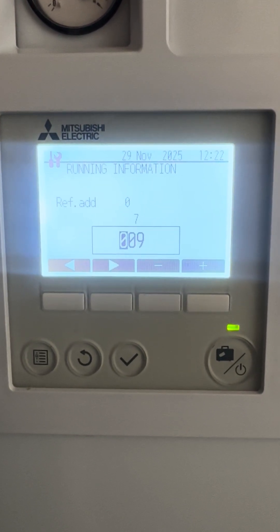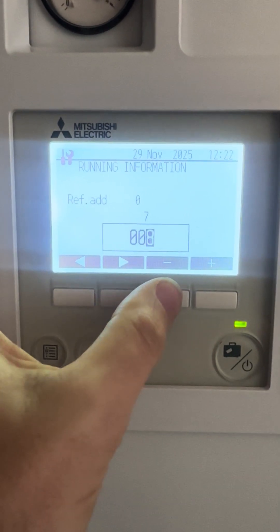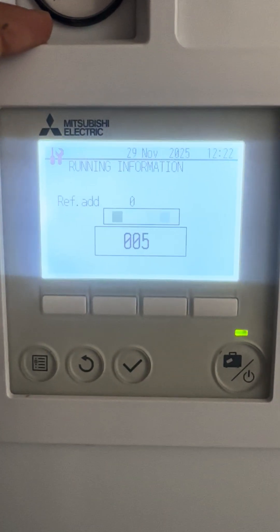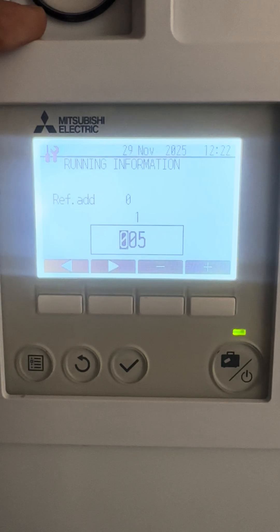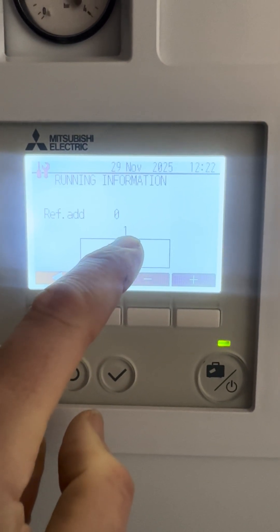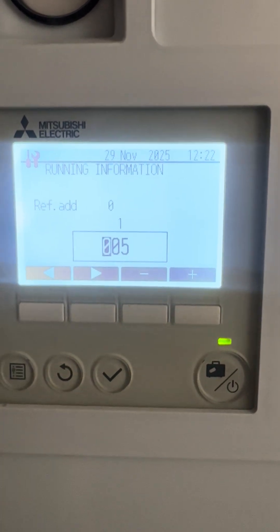When the unit has not frozen over, these two temperatures should be roughly the same — it's seven degrees outside at the minute and the unit isn't frozen over. Our heat exchanger is quite cold at the bottom, one to two degrees, which is good.